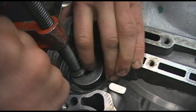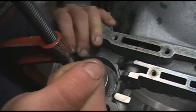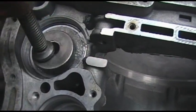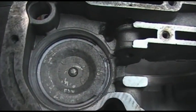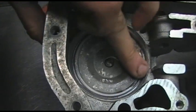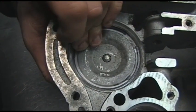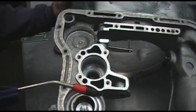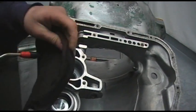Once you are confident that you have located the snap ring land and the snap ring is all the way home, you can remove your G-clamp. Just to affirm everything is in place, go around the snap ring and have a good look to make sure everything is in place — the last thing you want is this snap ring falling out.